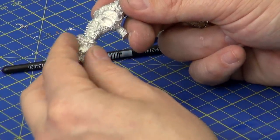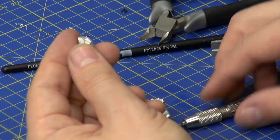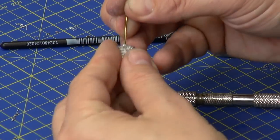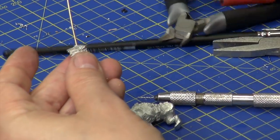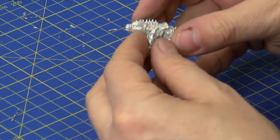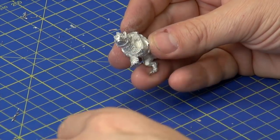This is not just a round joint. It's more of an oblong shape that goes in between there, right? Which makes it a bit more difficult to see where exactly the pin should go. What I usually do is I start with the male part of the joint, as usual, and drill that bit. A tiny pin, you put it in there. You cut away. As you can see, I haven't glued this one in. You cut it almost to the top, like that. And you push really hard on it, like that. That way the little pin inserts itself into the female part here. And as you can see here, it leaves a mark. And that's the mark where you know that the other hole should go.